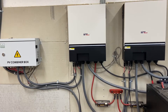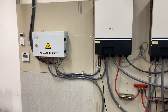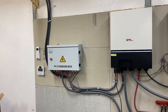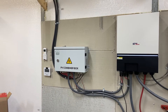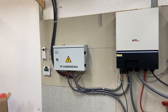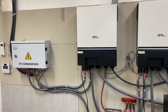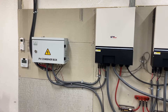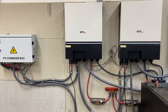Both of my legs can now be supported by sunshine since the wattage will be much more even. I'd be interested to see what my numbers look like from now on as far as usage and battery usage, because I was still using battery during the day — one leg was using the battery much more often than the other. This is maybe obvious, but this channel is really about learning and sharing ideas. Balance your load when possible, and especially if you have an inverter handling each phase — much better.